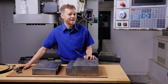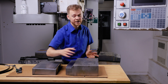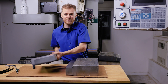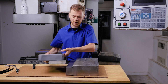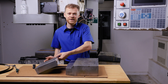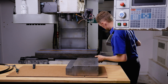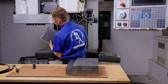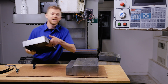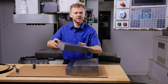You're going to want a 5/32 bit driver allen wrench — I think that's the easiest — and you've got two screws here and two screws here. You're going to want a putty knife in case there's any goop holding it on. On the backside there are two screws that hold it; they're pretty easy to take apart. Then you can slide the way cover back and pull the whole assembly out.